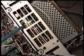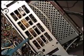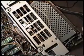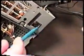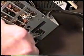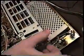If you can see these little black squares, these are the relays that we cleaned earlier with our resistor by passing a current through them to clean the oxidation, and this is the low-pass filter board. And this coax runs from the antenna connector to the board, and it's a little bit difficult to see, but right here you can see there's a little coax and it just pushes in, and we need to remove that in order to pull that unit back a little further. It's holding it, so we just take that little coax out. And there's only one coax connector right here, so it's easy to see where it's going to go back in. So when we take that out, it allows this to swing even further back.